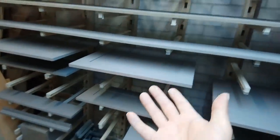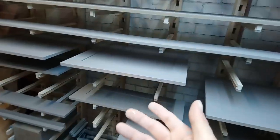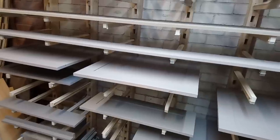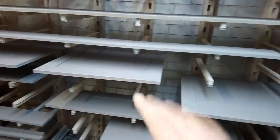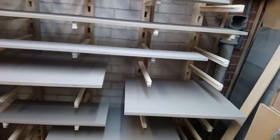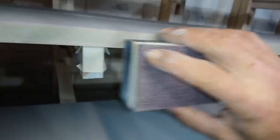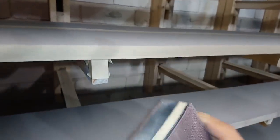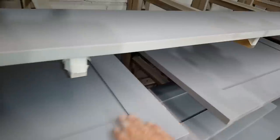This is the face, so tomorrow I can turn it over, put primer on the other side, probably sand that and give it another coat of primer. Then I should be able to get some top coat on by the end of the day, and by the end of tomorrow they'll be dry so I can turn them back over, do the face, and leave them face up finished painted to cure for 24 hours. I'm going to sand these edges smooth with the 120 - that first coat has prepared the wood and made all the fibres stand up on end, so the second coat should go on smooth.